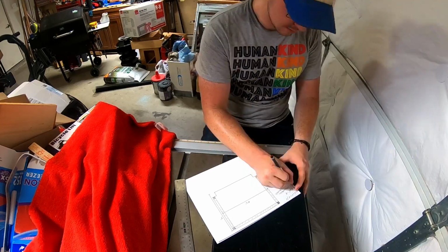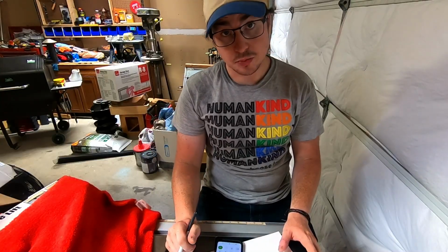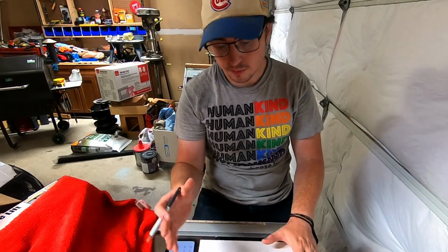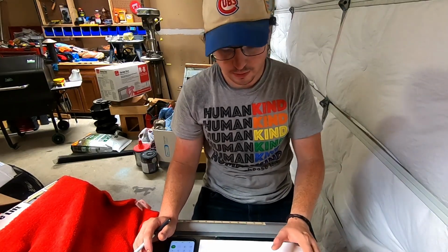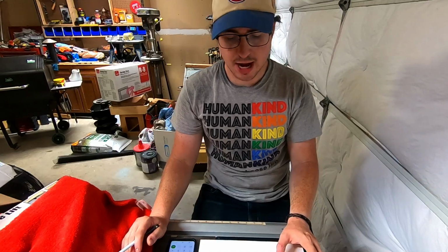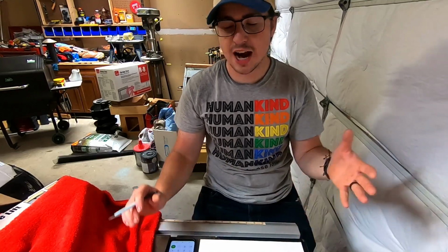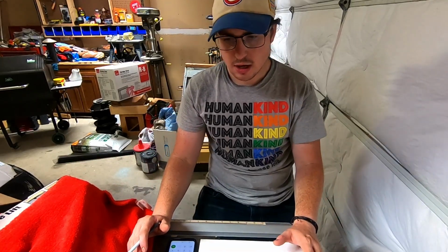Now I'm just trying to figure out how much of things I need in each place. I know that I need 4 4x4s. That's what everything's gonna attach to, because that's what's gonna go up to support the roof. I know I need 3 2x4x8s on the base to attach those four together and anchor everything to the ground. Those are gonna be our sill plates.